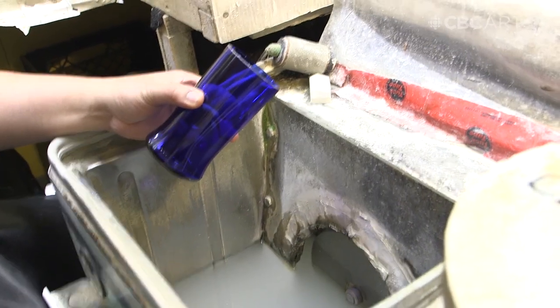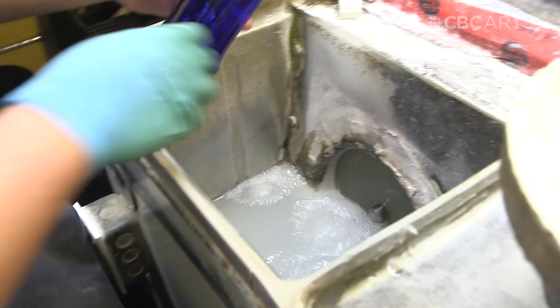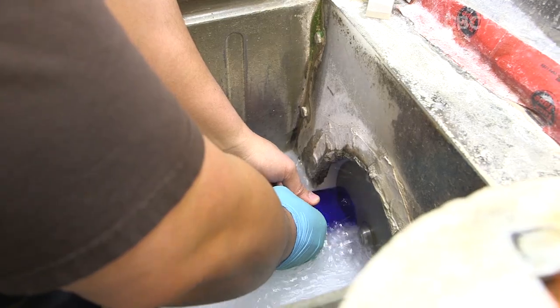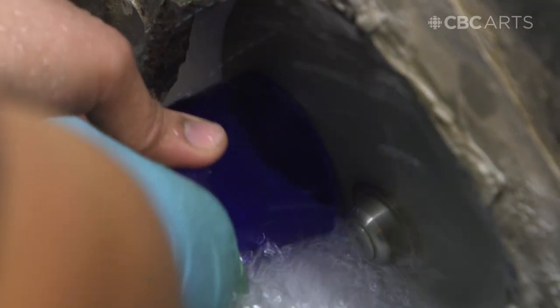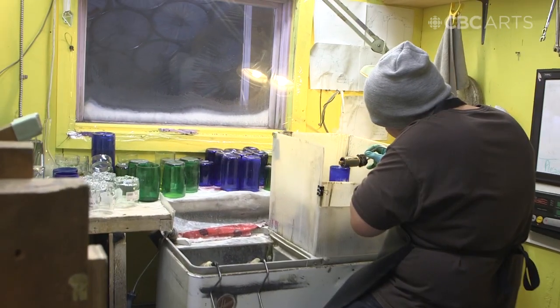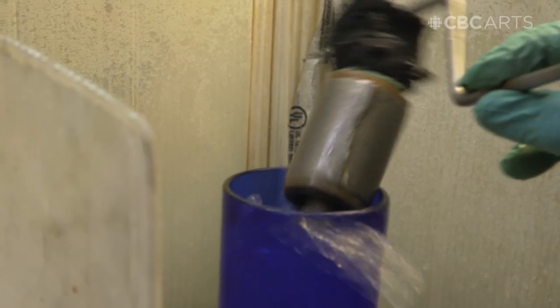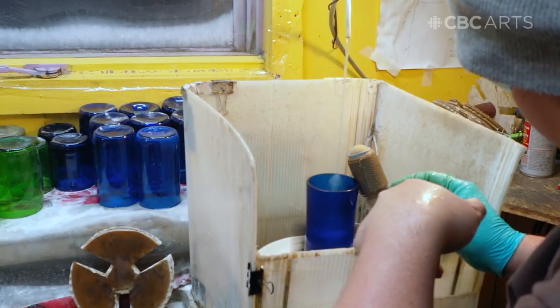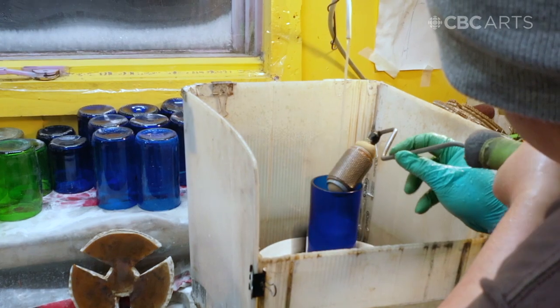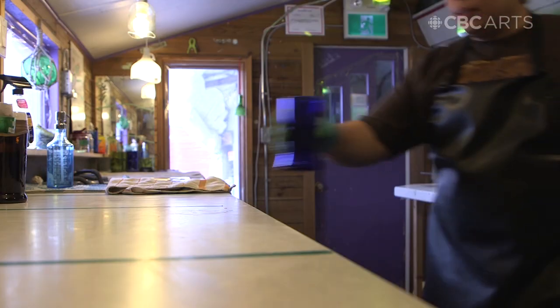So now we've got the top taken off and we've got a razor sharp surface. What we need to do is take it over to our grinder. The grinder is made out of a 1955 Hoover washing machine that's had the agitator removed and a diamond disc installed. Then we put it in the vertical lathe and turn it, and use diamond sandpaper to sand the square surface into a rounded surface, then finer grades of paper to bring it up to a smooth finish.